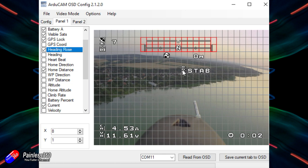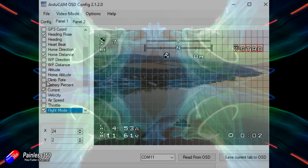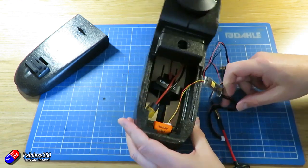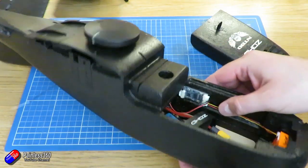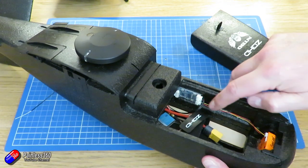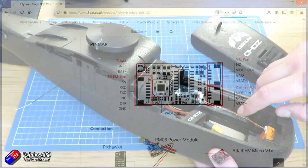It doesn't matter whether you're using Arducopter or Arduplane — it's going to work the same way. Once mine was set up, it was just a case of installing it into the model. I put a camera in the nose of this particular plane, put the Micro OSD V2 out of the way, and have the power connection into my video transmitter. Everything's working. The only thing to be careful of is to make sure that the power being supplied from the Micro OSD V2 to both the video transmitter and the camera is a voltage those two pieces will accept, because that isn't something you can change.